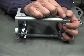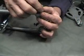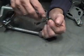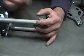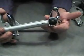The caps have been modified here, so they have a little plug in them now that you can pop out, and then you can access this cap very easily, pop the cap out and re-lubricate the bearing or the cams here. I see websites that say it's not important, just strictly do the spring part. No, that's really not sufficient to do.